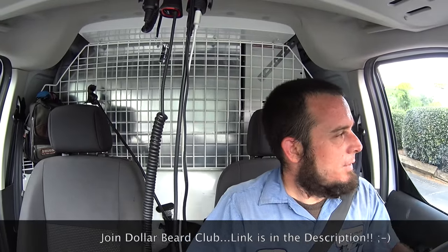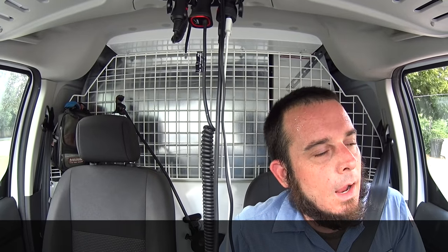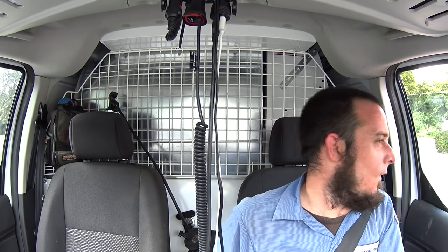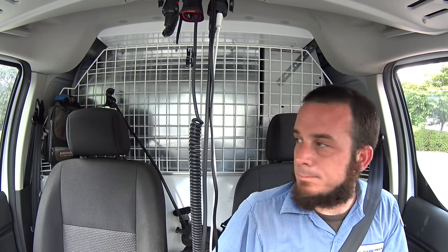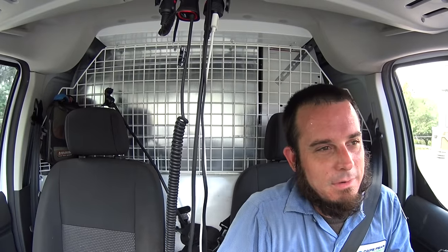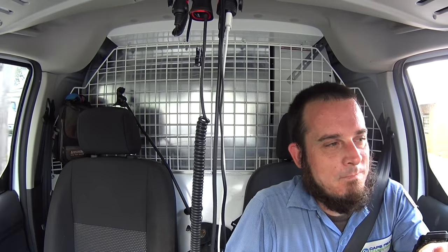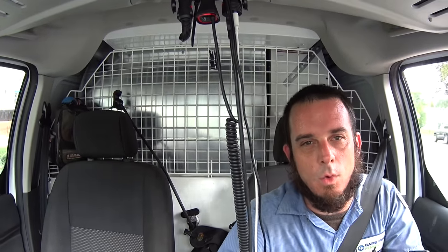Well, that was exciting. I went to hook up my Appion G5 Twin. Was using a cheater like I've used so many times. Next thing I know, the compressor starts running on the recovery machine. The compressor stops, the compressor starts, the compressor stops. And then I hear a pop and smoke blows out. So I'm running over to Johnstone Supply up off of Six Forks in Raleigh to grab another recovery machine. Definitely a little bit drastic to replace a whole recovery machine, but I need one.